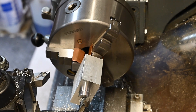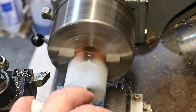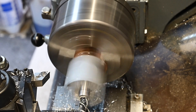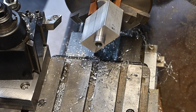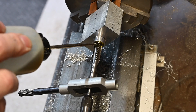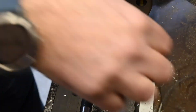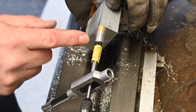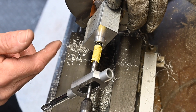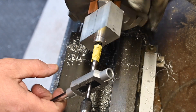I've got to drill that out for a 10mm tap now — it's an M10 by 1mm thread so I'm drilling it with a 9mm drill bit. Now I'm just going to tap an M10 in there. I've put a little bit of tape on the end of the tap because it's easy with soft metal like aluminium to be tapping away and not realise you've bottomed out and pulled the thread out. The tape gives me a guide so I know when I'm near the bottom.